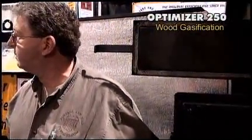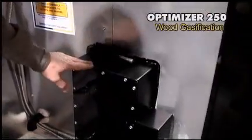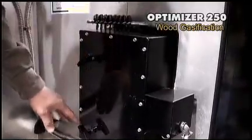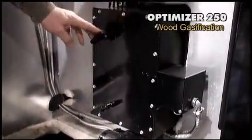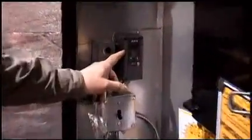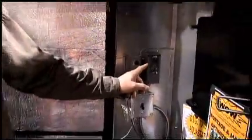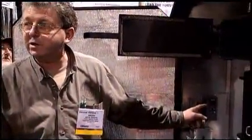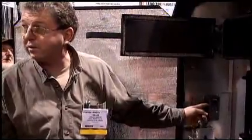This unit would be close to 250,000 BTUs — we're rating it at 180 to 250,000. This is our air box; the fan blows air into the air box, and it's adjustable above and below the fire simply by turning the knobs. Once you get it set, you just leave it. The Aquastat is a Johnson Control A419 — very reliable, good quality, available off the shelf. It's not something made especially by the manufacturer that you have to go back to them for.